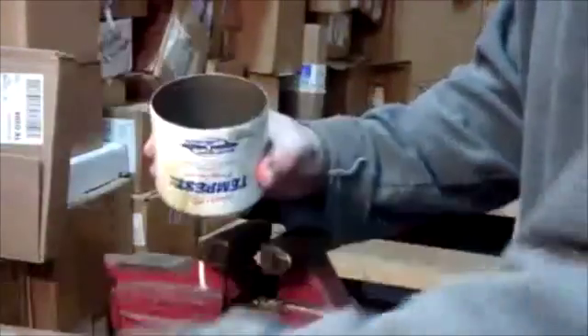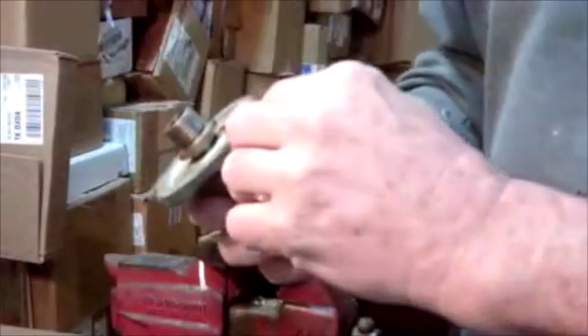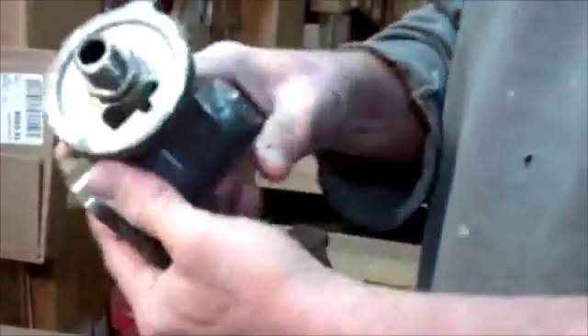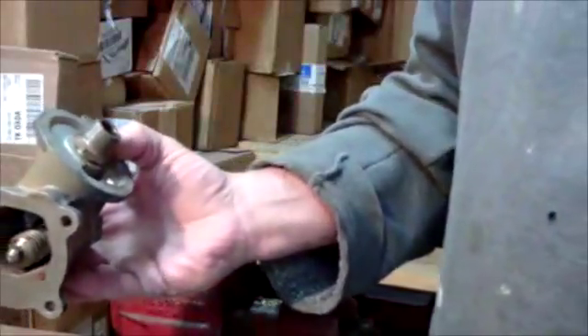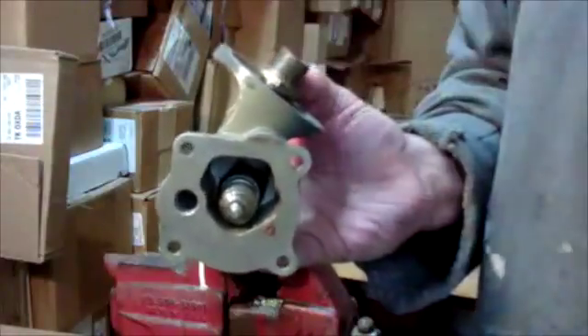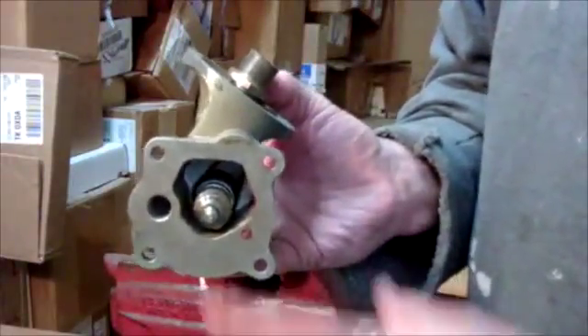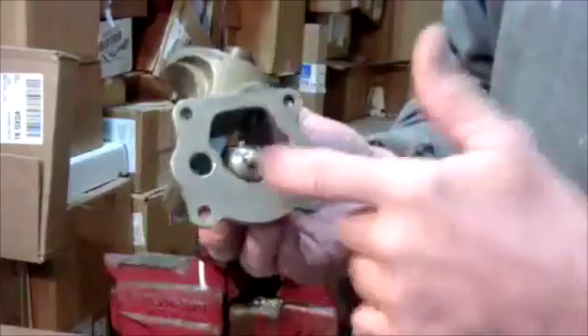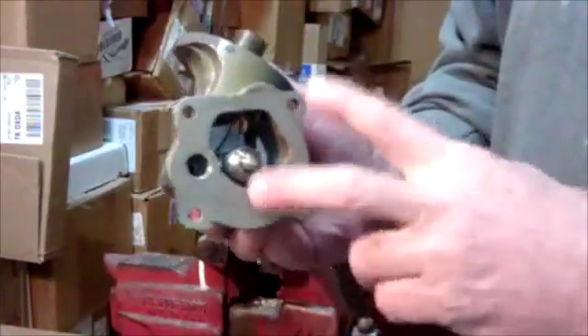Be careful — these metal edges are quite sharp. For those of you with two-seaters who want to add an oil filter adapter, here's a really nice one. It throws the filter upward at a 45-degree angle, so when you go to change your oil, the filter's already drained back into the engine. It's a no-mess oil filter change. It's the only spare one I have left. If you're interested, give me a call at Yankee Aviation — I'd be happy to sell it to you for your two-seater.